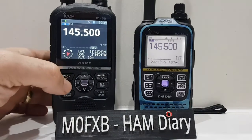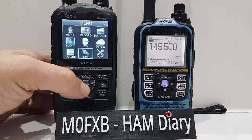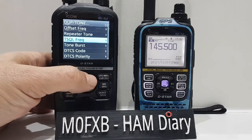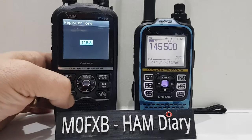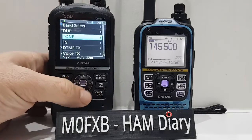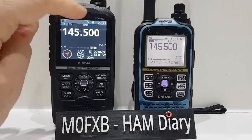While I'm here, I might as well go the other way. So let's set a tone on the 52 — very similar to the 51 actually. What you do is go menu, then go to the grid and to set. At the top you've got duplex tone, go to repeater tone. Now if you're using tone squelch, then you would select this one, or just doing a normal repeater tone. And look, we've set 118 already. Back out of that, hit the VFO. Now we still need to turn the tone on, so go quick here, go to tone, down to tone, and turn it to tone — not tone squelch, just tone. So we're now going to be TX-ing simplex a 118 tone.